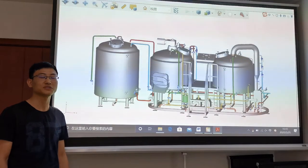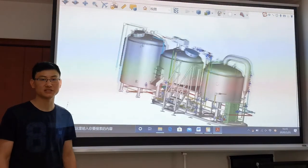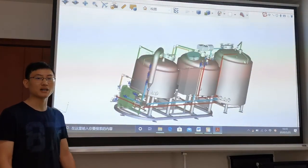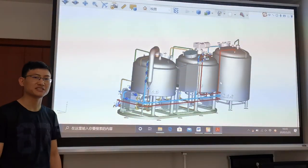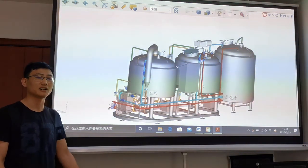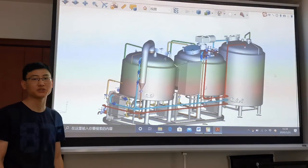There is a stainless steel plate heat exchanger that can cool down the wort within 30 minutes. You can adjust the volume of the wort and tempering water by adjusting the flow valves. There is a temperature gauge installed so you can check the temperature outside, and also a temperature sensor so you can check it on the control panel.